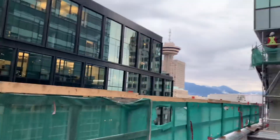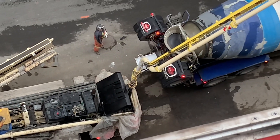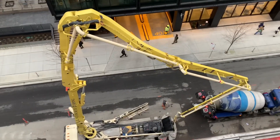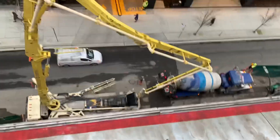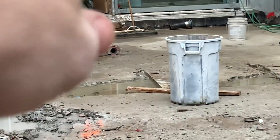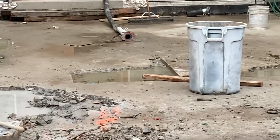Just another little tidbit to add on — what we're going to do for priming out. He's got a short little double-ended 3-inch hose down there, so we're going to prime out in the hopper, cycle around, get it nicely mixed up and blended, so we're not trying to prime out with that rocky, typically rocky first half yard of concrete. We'll cycle around, pinch off with the air cuff. I'm going to throw my bentonite not in the reducer but the other end of the hose, such that I can roll the slurry back through that first hose, thus coating the entire diameter of that reducer, and then we'll hook up to it and prime right out. That's how we typically do it.